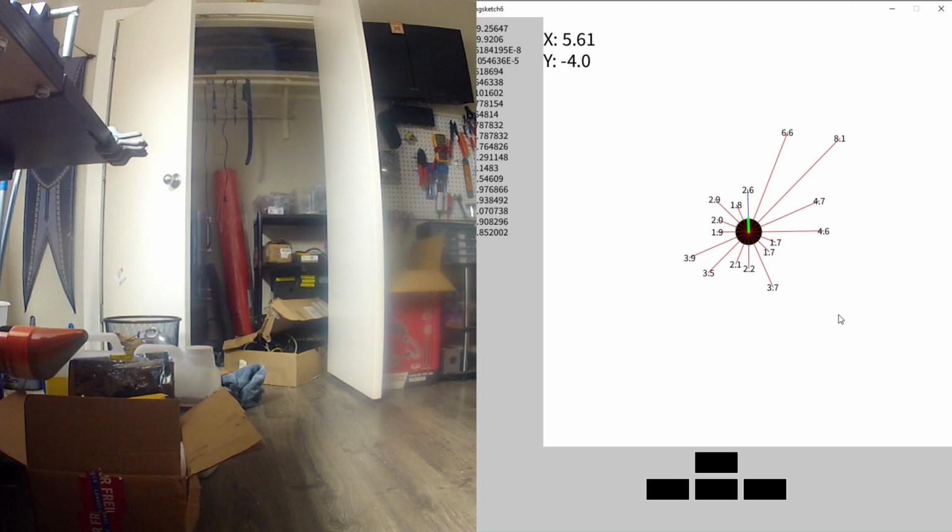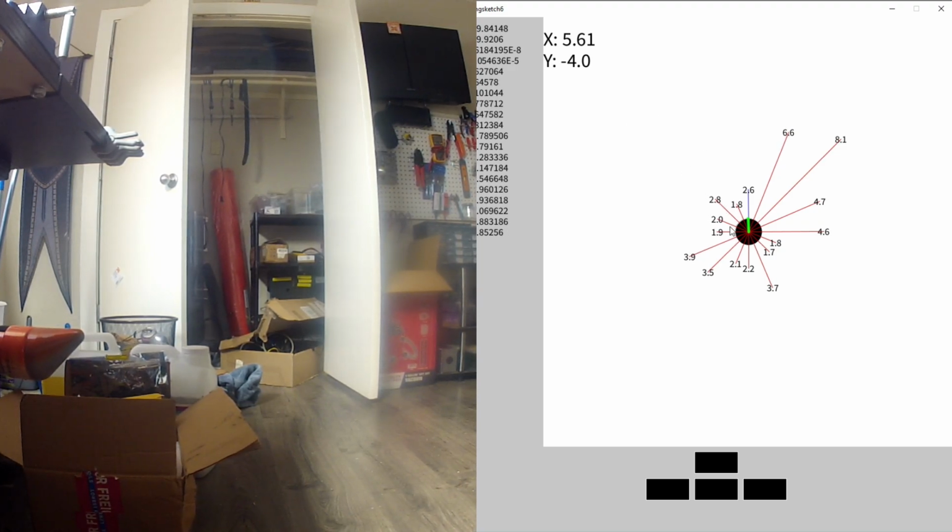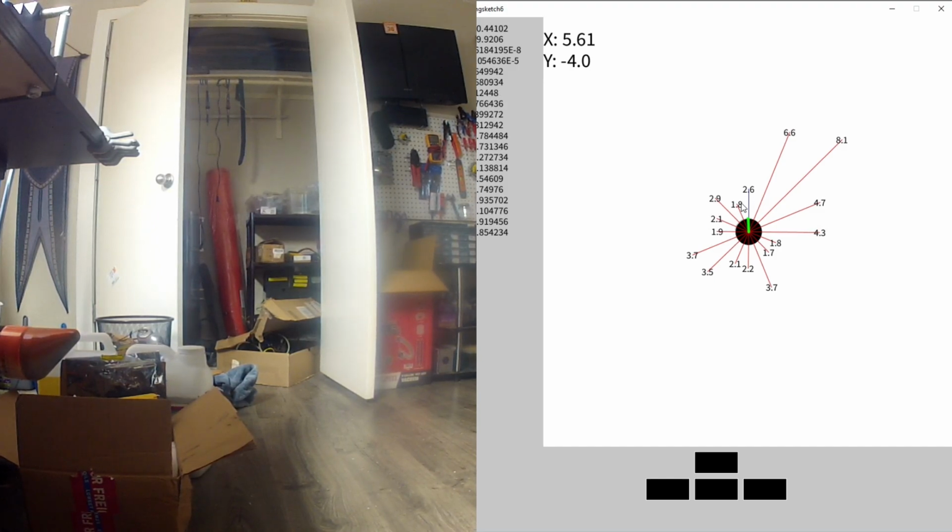Okay, so a couple of things went wrong on that first attempt, which I believe I have corrected and I've reset. The sonar echoing was timing out when it was near the couch. It just wasn't getting a good reflection off that soft surface. And the timeout was set to 2 seconds, which if that is happening on 3 or 4 of the transducers, that's like a 10 to 12 second period. Also, the way my code works, it stops updating the signals it receives and sends as well, because that just stops all of the code.